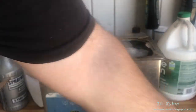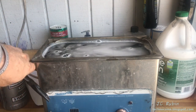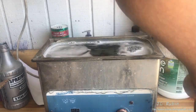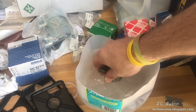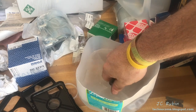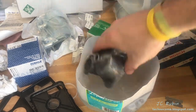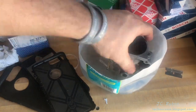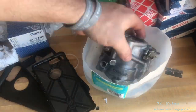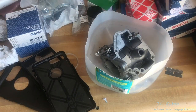We're finished with round two — that's going to be it. Shut off the heater, going to pull these out and let them come to room temperature before I rinse them off — I don't want to shock the metal. I'm flushing the parts in distilled water to get the remainder of the detergent out. I did wait for the parts to cool so they don't crack under stress. I'll refill with distilled water and do this one again. Now I'm going to blow everything out.